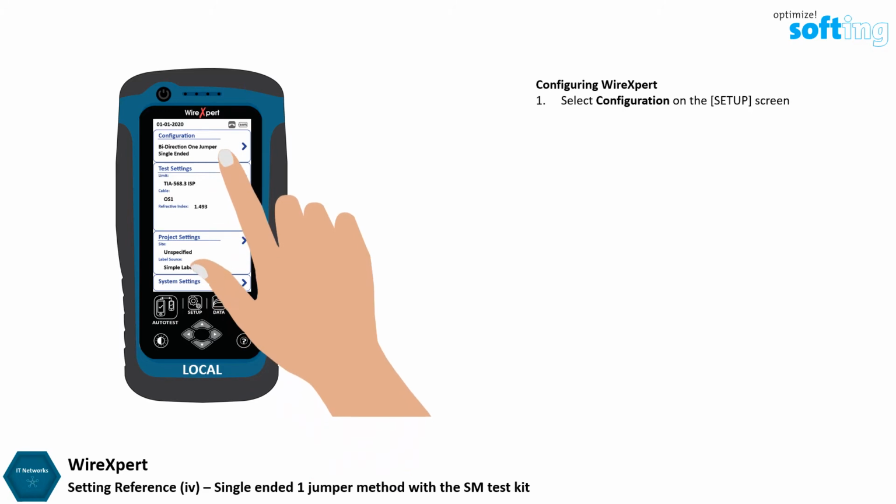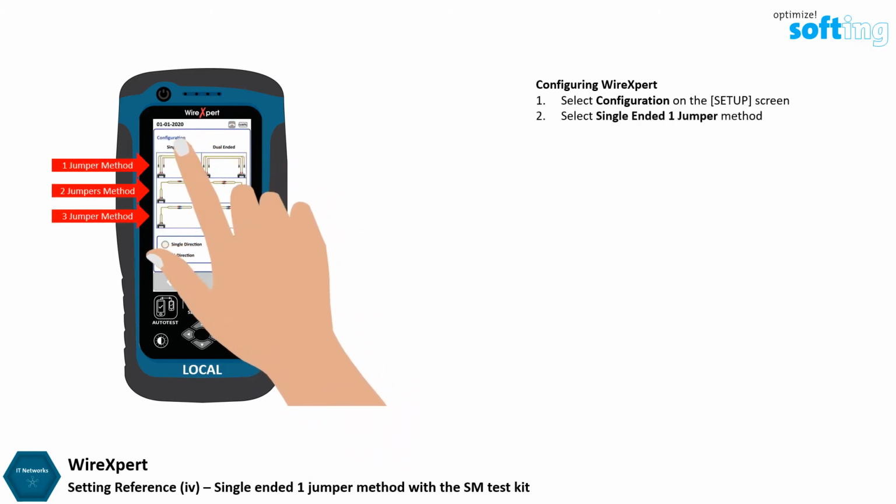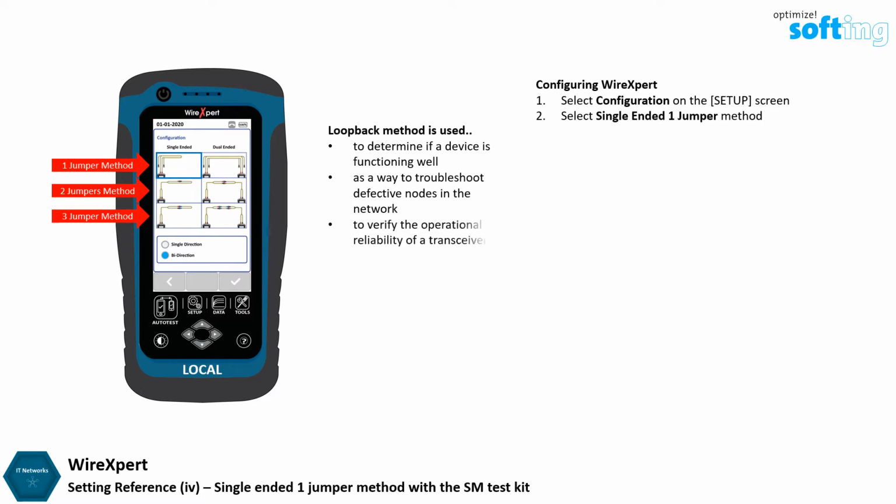Select Configuration on the setup screen. Select Single-Ended Loopback One-Jumper Referencing Method. A loopback test is used to determine if a device is functioning well or as a way to troubleshoot defective nodes in the network by transmitting a signal and looping it back to the same communicating device. Loopback test is typically used to verify the operational reliability of a transceiver.